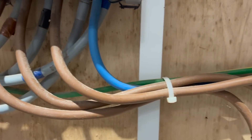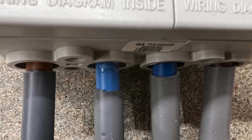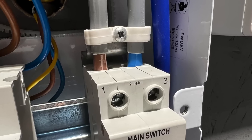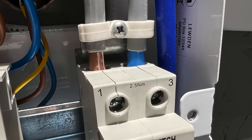Now I do get asked about meter tails. I mention this because I've been on lots of jobs where the previous electrician has stripped the outer insulation back to expose the basic insulation for identification purposes, normally where cables enter a meter box, service box, or a neutral block. This would not satisfy BS 7671 as the tails at that point would have been reduced to the basic insulation only. If however it was contained within an enclosure like the top of a main switch, that would be okay, although sleeving does just as good a job.